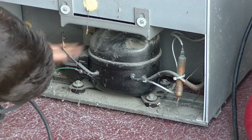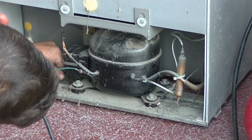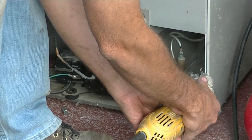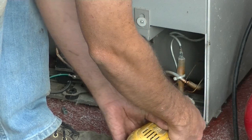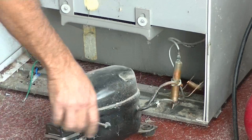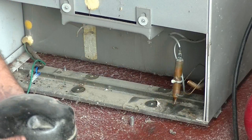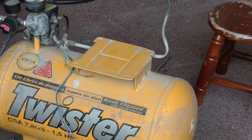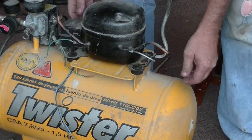This particular tank has a nice platform that will allow space to bolt the compressor on. This is an old little refrigerator I've had — I haven't seen anyone else use the small compressor from one like this, so I'm not sure how it's going to work, but it's free. The freon has leaked out but the motor still runs, so I go ahead and cut it out of the back of the refrigerator. It comes out pretty easily, and that platform on the old tank gives me a place to mount the refrigerator compressor.